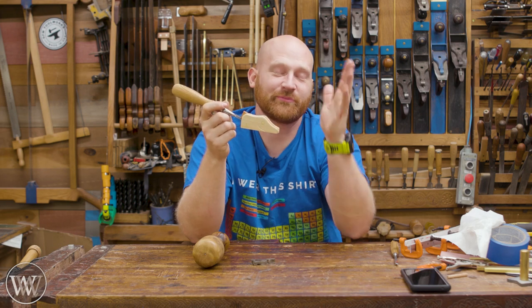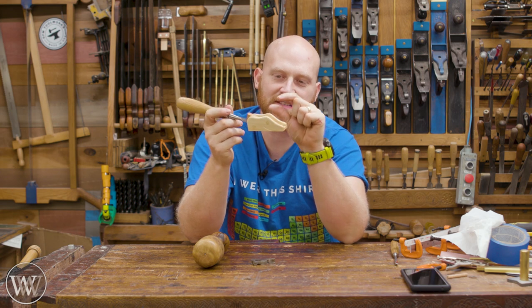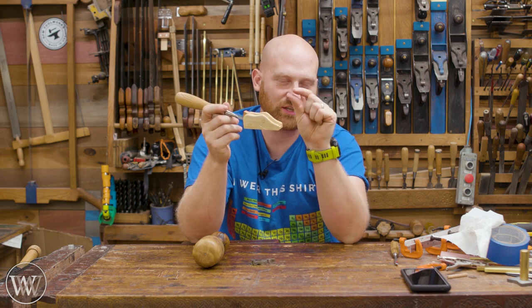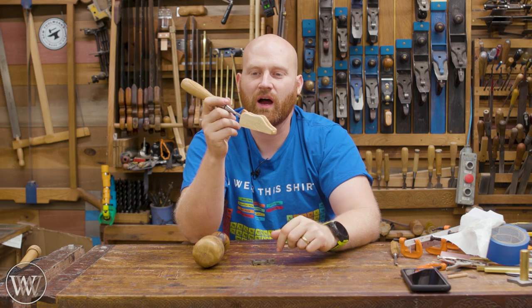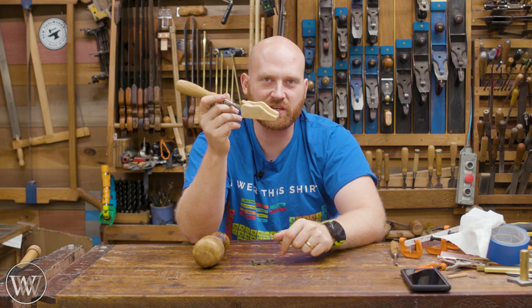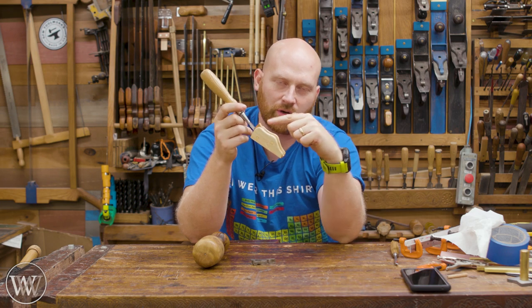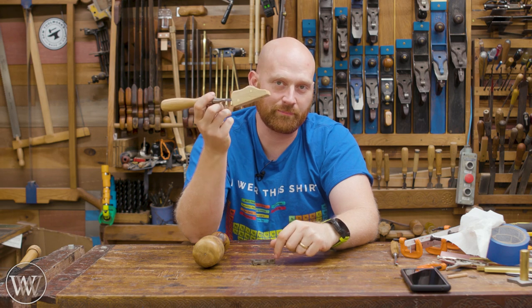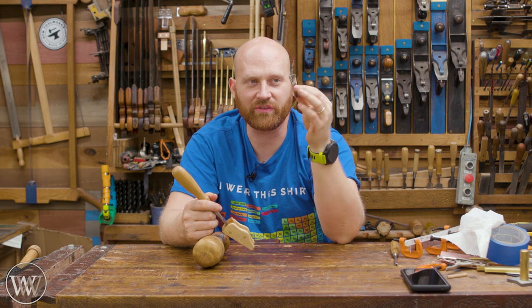This was really a prototype - I was kind of experimenting and seeing if I could make it any smaller. I could - if I made the distance from the pin to the plane a little bit less, I could probably halve that distance and make this about a quarter inch shorter. I wouldn't need to make it quite as big at the back. I think I'd like to make the wedge a little bit longer so that I could put a hook on the end to eject it. As a prototype it works out very well. It's probably not a tool I'm ever going to use, but I have a whole video on this little thing talking through what it is, why it would be used, and what in the world it's for.